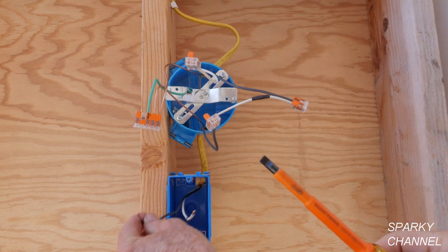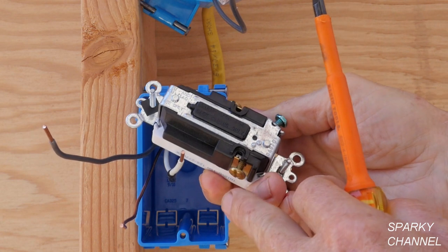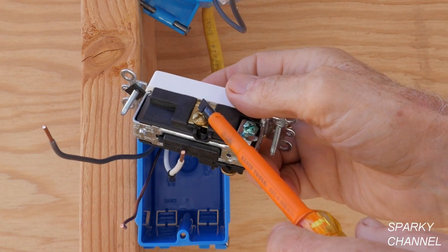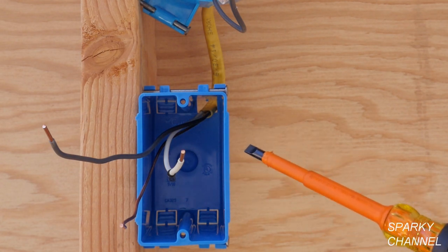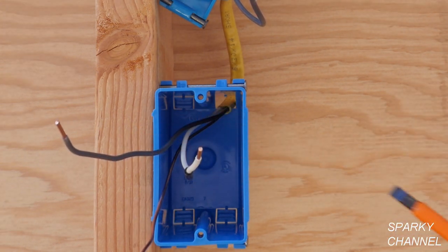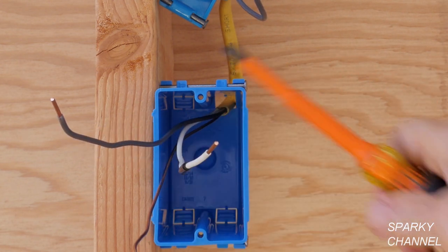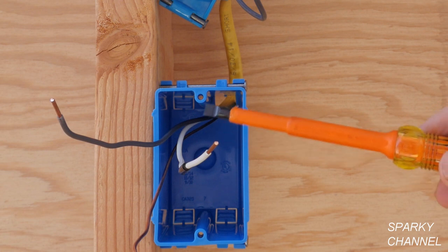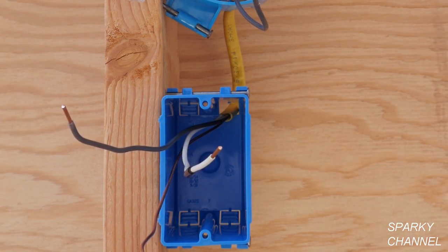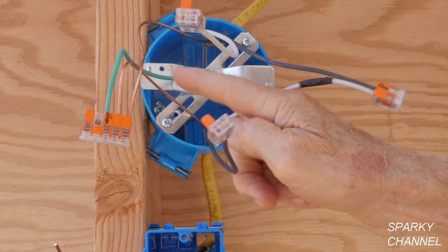The switched black wire that comes from the switch box you would also hook to your light. You'd have a switch where one wire is connected to one bronze terminal, the other to the other bronze terminal, and the ground connected to the ground. In older homes from the 50s, 60s, early 70s, a lot of times you won't even have a ground wire — it'll just be a white and a black, and maybe they didn't even color code the white wire. In the 50s and 60s, these wires are cloth coated; the black gets lighter, the white gets darker, and they both look gray — you can hardly tell the difference. That's what you see in older switch boxes. The grounds come in from this cable and go out down to here, with another ground going from the wire connector to the cross piece. This is the way it was done prior to 2011.